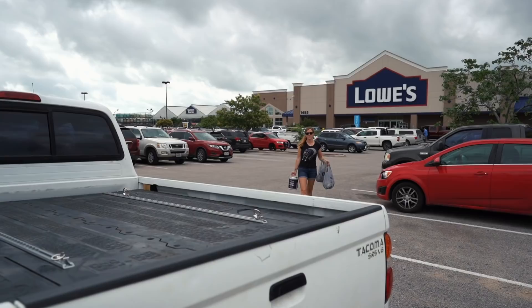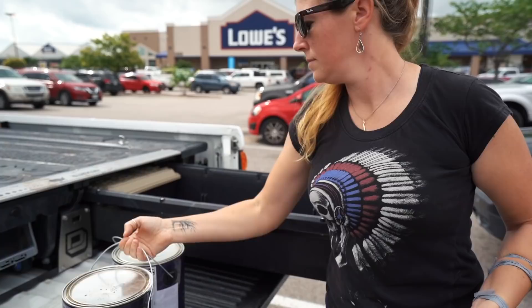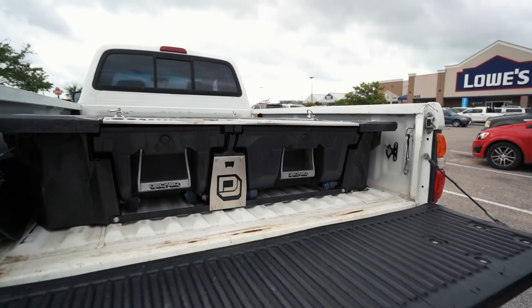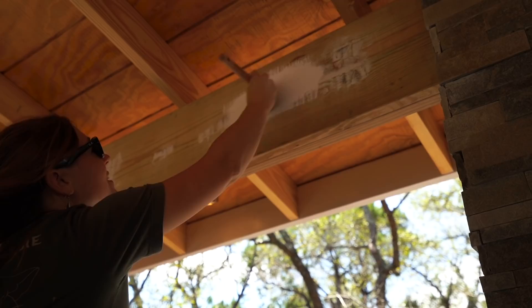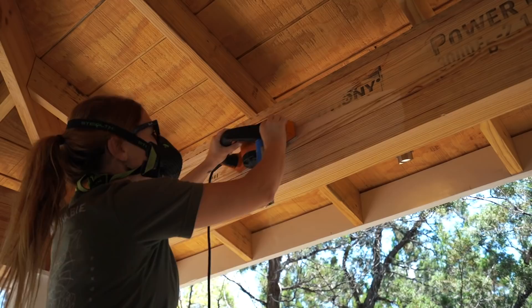Now a collection of tips relating to the actual painting phase. To round up paint and primer, I went to lowes.com and chose the Valspar products I needed, then just picked them up curbside at the store — incredibly fast and easy. If you're a busy pro, check out the Valspar Pro offerings, where you can get linked up with a dedicated rep and access business services like order tracking and management tools. Knots and ink on lumber can and will bleed through paint, especially if you're going with something light. To prevent that, I like to spot prime these areas with a stain blocker before priming. Valspar's stain blocking primer seals in stains so they won't come back to haunt me. It's also great for glossy surfaces that other products won't stick to.